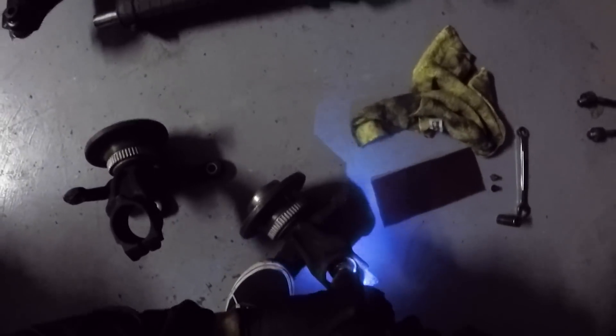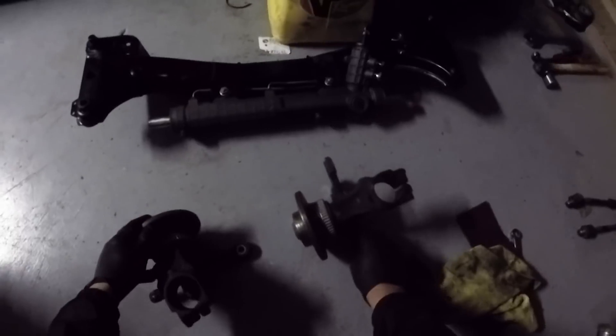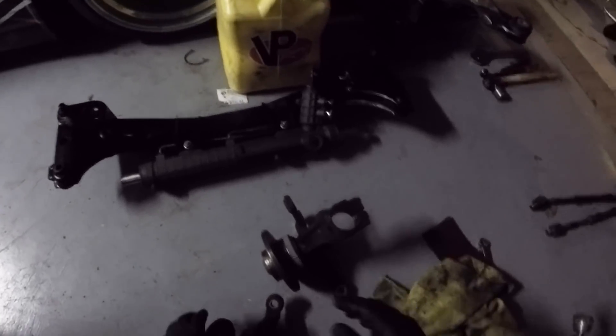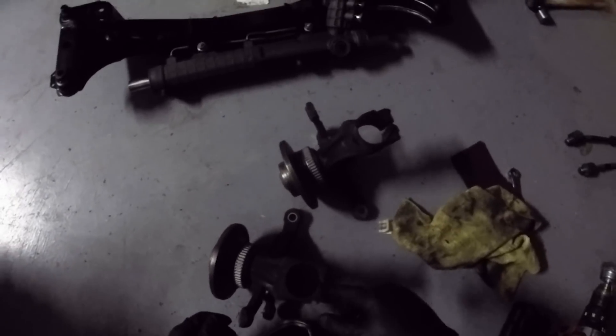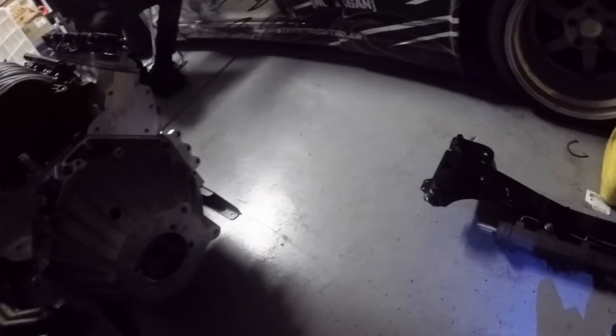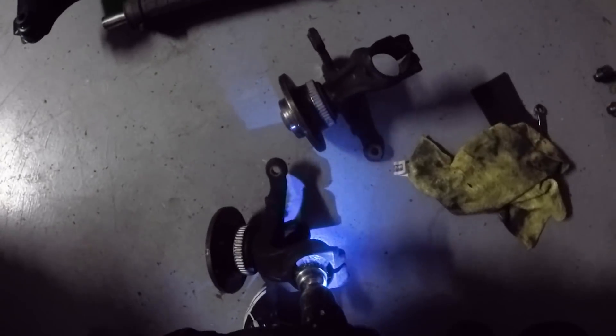We can get some of the inner areas cleaned out at an angle. This has grease on it, which is actually really nice and will help keep the rust off too — kind of a pro tip. If you're trying to keep rust off raw parts, put a little bit of WD-40 on the surface. It won't stay for very long, but if you're in the middle of fab work and have to stop, spray some WD-40 on your stuff and it should be fine for the next three days without having to clean it.